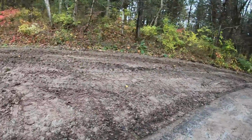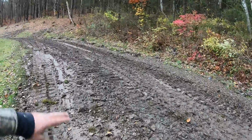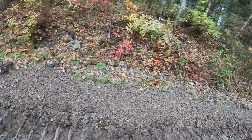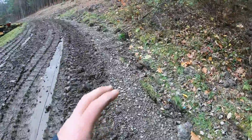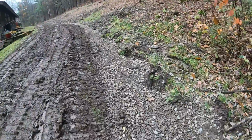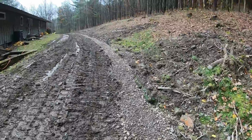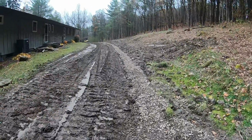on some DIY projects. So basically, like I told you, there's going to be a pool in here in the spring. So we're not doing aesthetics or lawn or anything. We're just grading out to get everything to work to our French drain. You've seen the French drain installed. Remember, fabric at the bottom, pipe in there, U-shape with the fabric, clean stone on top, most effective way. You can topsoil over this at another point, but for the first few months, you want to see how it's working. And if you're confident, then you can put a thin layer over it.